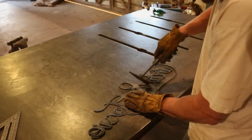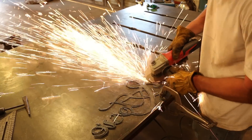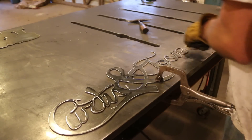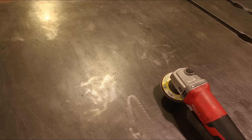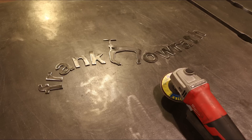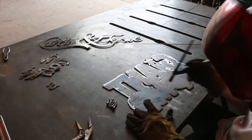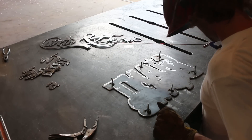The next day, after I finished on the farm, I headed back to the shop for the evening. I started working on cleaning up the cutout pieces. A lot of the bigger slag can be easily chipped off with a hammer, and then the rest I cleaned up with a grinder. On the front side I used a flap disc, which leaves it soft and looking nice. That was my first and last attempt at stop motion — I think I just embarrassed myself, especially if Frank watches this. I'm going to leave that to the pros.